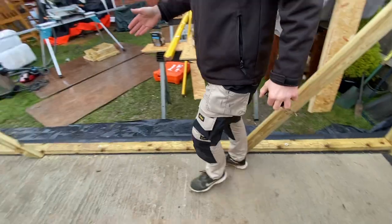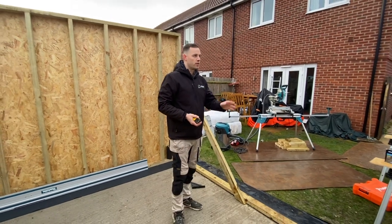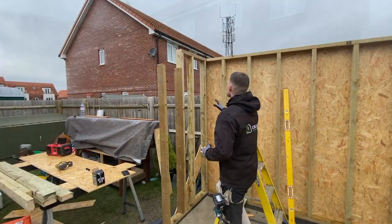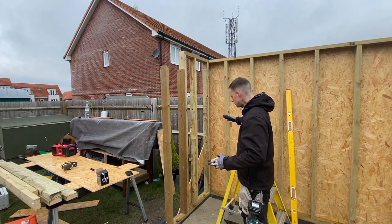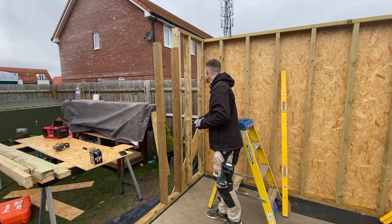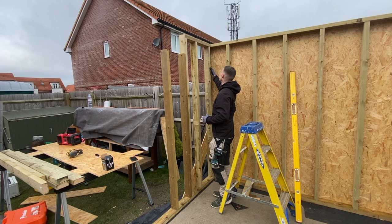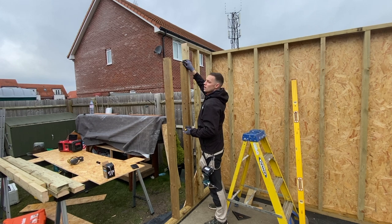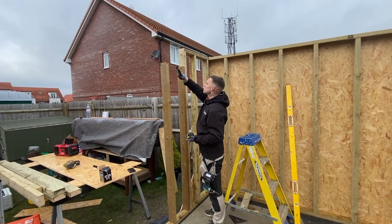Same on the other side. We've marked it all out, so let's get onto that — we're going to cut some wood and fix those up. We've got our uprights up. We built this wall freestanding. We've marked it all out and cut these to size — these are just going to be our two 180s. Then we put a plate on top of it, and then we've got our 8x2, which is 200mm, going to be the joist that sits across the top — our lintel.